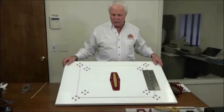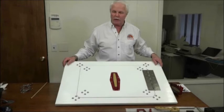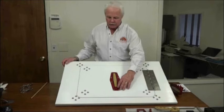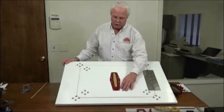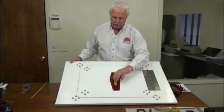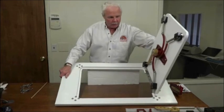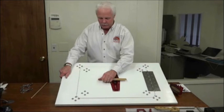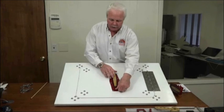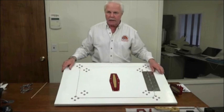To demonstrate operation from the outside — for rescue personnel or crew members servicing the boat — the outside T-handle is recessed and has a spring-loaded button engraved with 'push.' When you push the button, the handle pops. You rotate the handle 90 degrees and simply open and close the hatch. To put it back in the locked position, rotate it 90 degrees and the four locking pins engage. Push the spring-loaded button, push down the spring-loaded handle, and it's locked in place, ready for re-engagement.